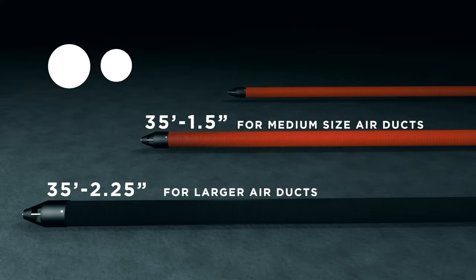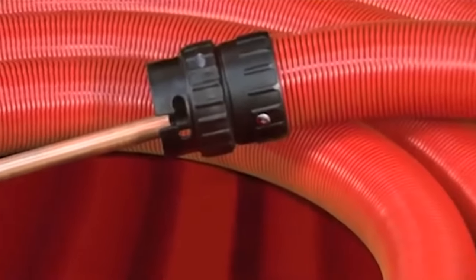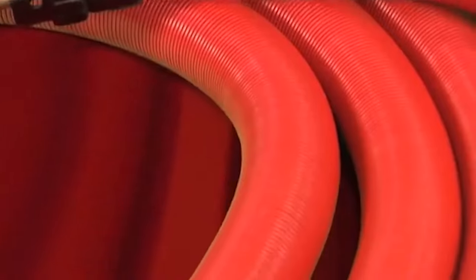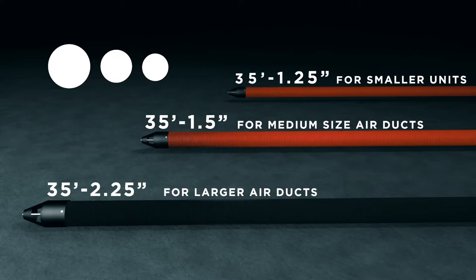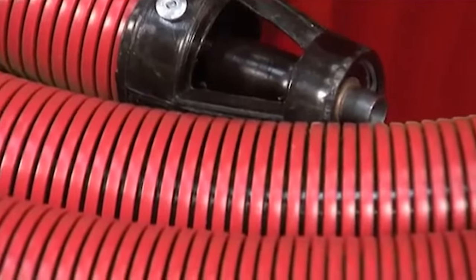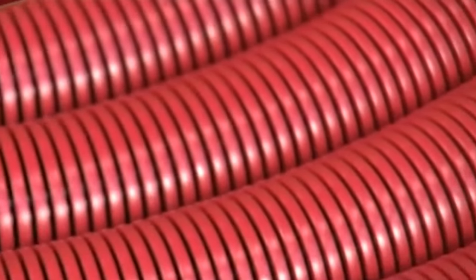The 1½-inch hose has about half the air flow of the 2¼-inch and is a lot more flexible, so where the 2¼-inch doesn't fit, you will use the 1½-inch hose. Next, we have the 1¼-inch dryer vent hose. The most air flow this can handle is a 6-inch duct. In most cases this is used exclusively in dryer vents, but occasionally wall stacks.